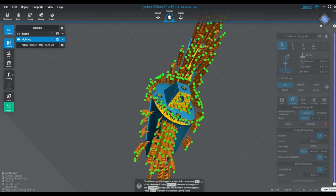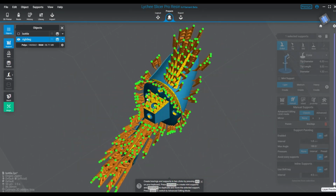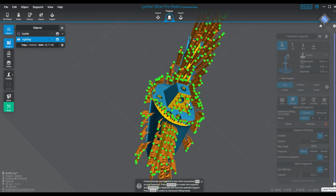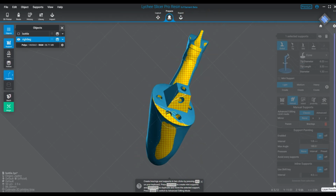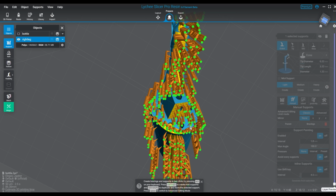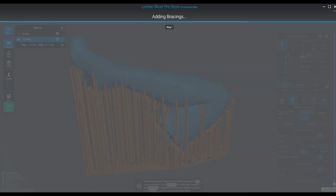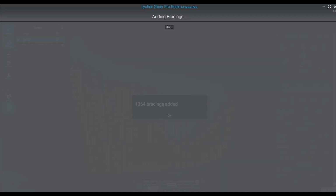So don't forget to fill in all the yellow areas here. Make sure you finish all that up and support everything you need to. Obviously, for any of the limbs, if you need to do any internal supporting, make sure that you check the islands there and do any internal supporting. On this particular one, I did just the minimal island supports and kind of left most of it up to the walls themselves to support the print. And in most cases, I find that with limbs like legs and things like that, it usually isn't much of a big deal to leave out a lot of the internal supports. So we'll go ahead and do our last island check once we finish off these supports, and then we will run the final slice, and that'll be it for this one.